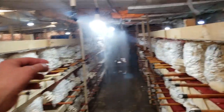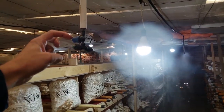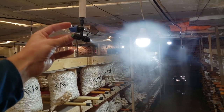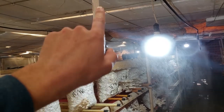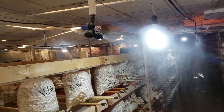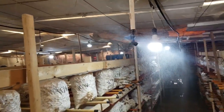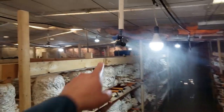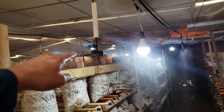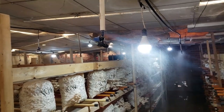These nozzles are very similar to DIG brand nozzles. There's an anti-drip fitting here — it could also be a flow controller, but typically it's a check valve that needs a couple pounds of pressure to open. When the supply pressure stops, it seals the valve. This prevents the lines from draining and stops calcium from building up on the nozzle from constant dripping and evaporation, which reduces maintenance.